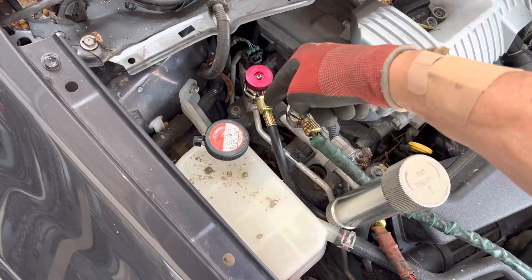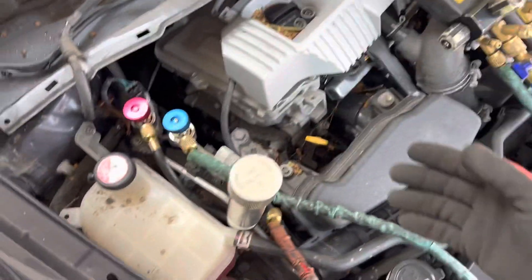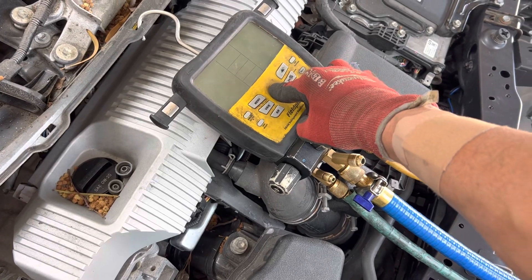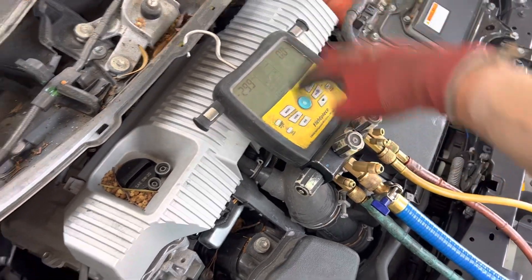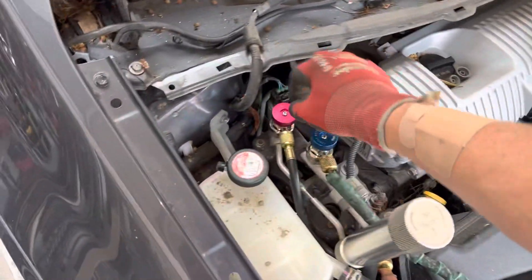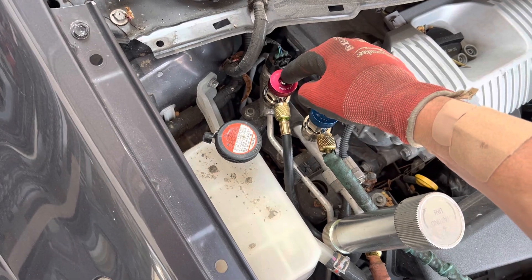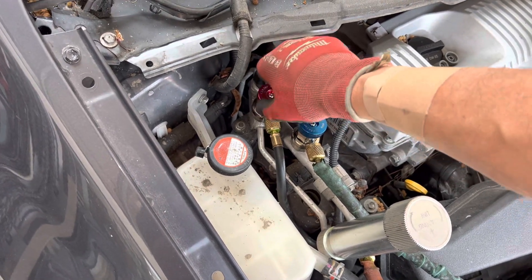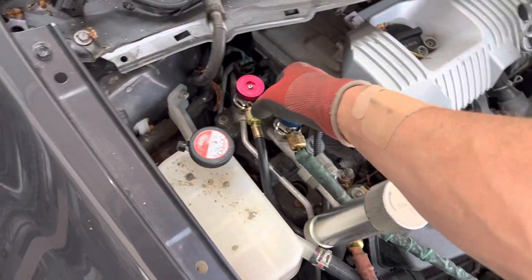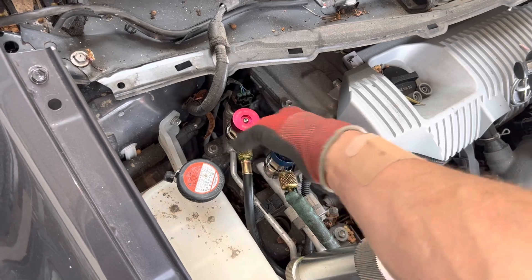We now have our oil inside the system. Make sure you don't just take this off and forget, because you'll suck air in and undo all the evacuation work you did. The battery timed out after 15 minutes — the batteries turn off to save themselves. Back this out so when we disconnect it you don't suck in air. You do not want to suck air into your system.